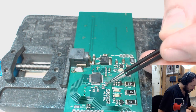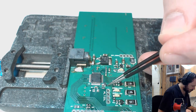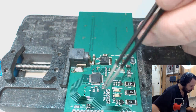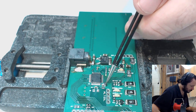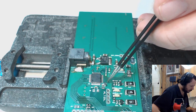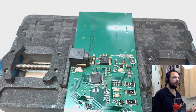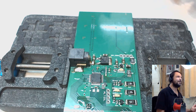And what we're going to do is just angle it on here like that. Oops. And so this pin here is the gate. This one here is the ground, or I really should say the source. And this one here is the drain side. And then we're going to run a wire from that over to Tombstone Valley. All right, that's the theory. No one's perfect, it's not the end of the world.